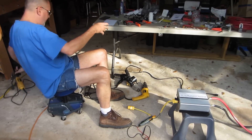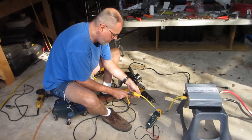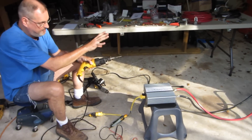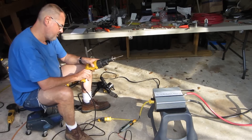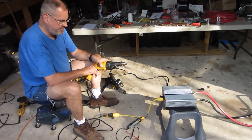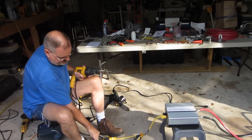The next thing I've got is a DeWalt drill, and this is rated at 7.8 amps. This battery is fully charged and it's only a single battery — I'll have a dual battery system — and it's nothing but the battery and the inverter. On start-up, that jumps to about 8.7 amps and runs steady at about 2.5. They must have reported the peak amperage on this one.